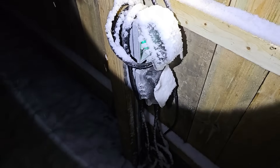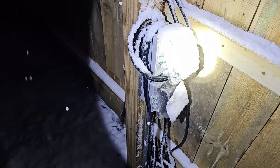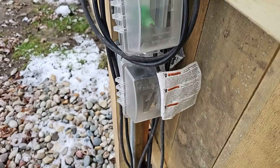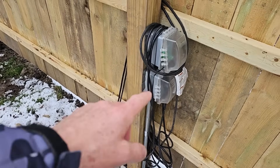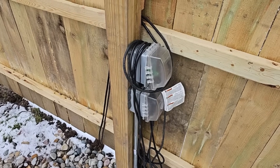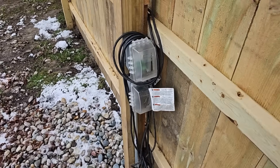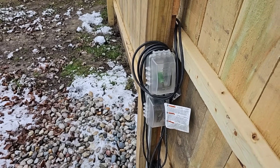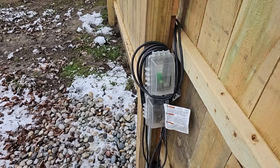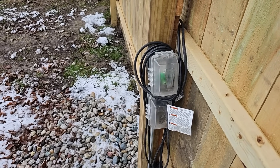We're really deep with that sump, so I got to get a heater in there — it's getting about that time. I don't have a heater in there yet because we're about six feet deep with that sump. This one is our backup pump, this one is our primary pump. They're on separate breakers. If this pump shorts out and throws the breaker, my backup pump's still going to work because it's not plugged into the same breaker — that is key. You want to do this indoors and outdoors, always. If your backup sump pump is sharing the same breaker as your primary, that's pointless. Most of the things that take out a sump pump cause it to throw a breaker — outside of a failed float switch, which is the number one cause, the next thing is they short out.